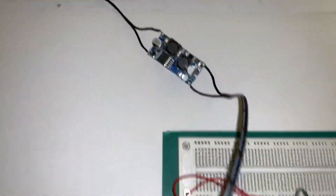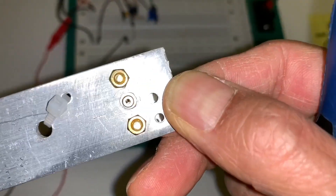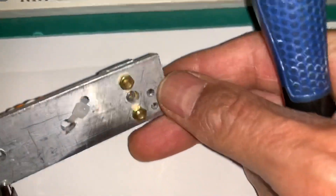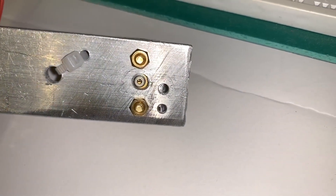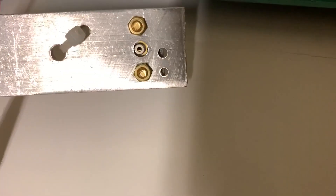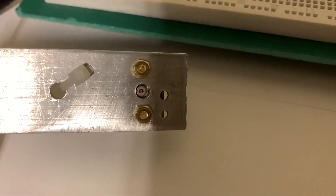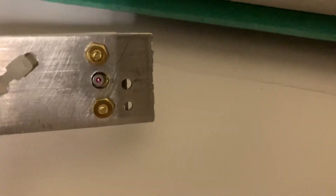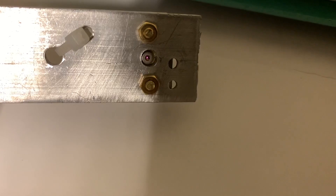We're going to test it - I'm going to turn it on and look at it directly with this phone, and you should see light. To my eyes, if I was looking at that directly - which I wouldn't be doing because it would blind me - I wouldn't see anything. The only way you can safely look at these is with laser glasses. I'm looking right down the barrel of the diode and I'm going to turn some power on. You can just barely see some light, and that's invisible to the naked eye. That is infrared light, which I believe is around 808 nanometers.